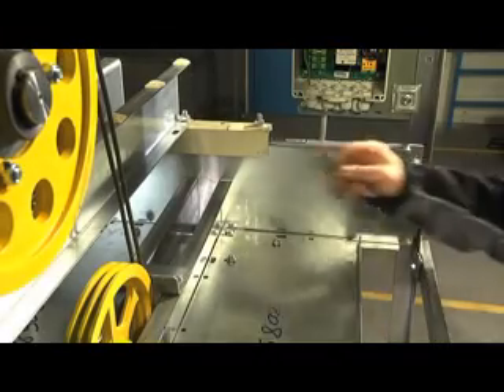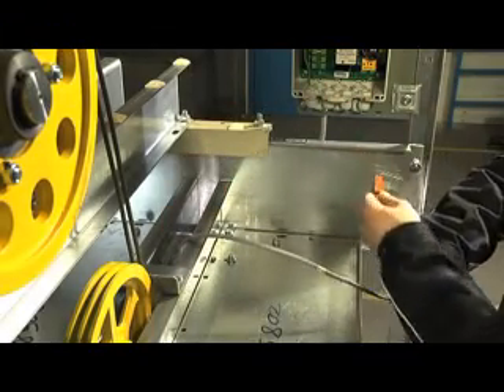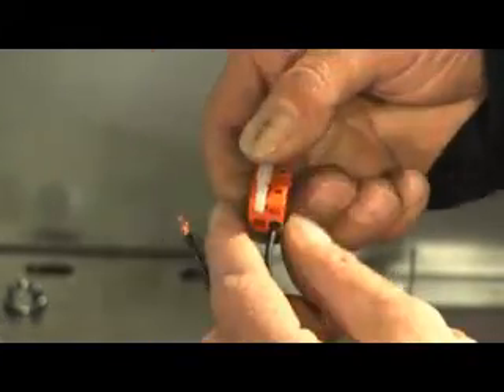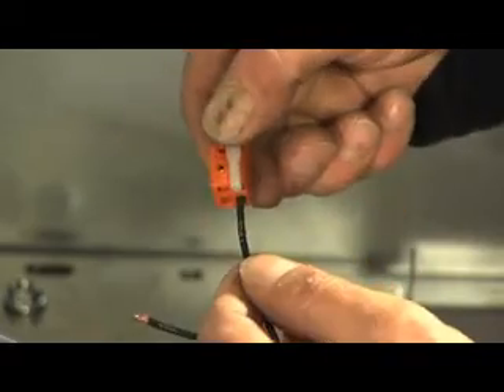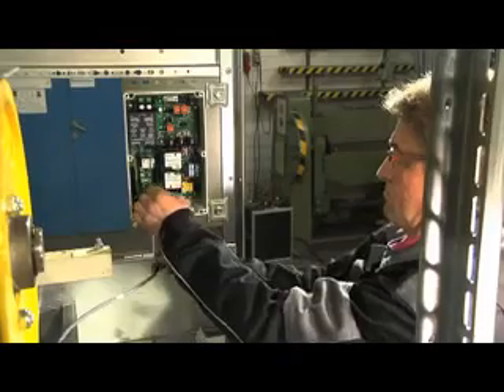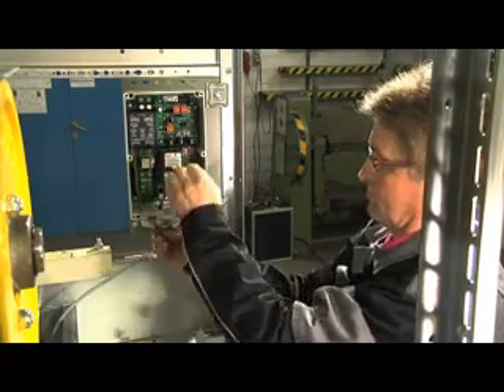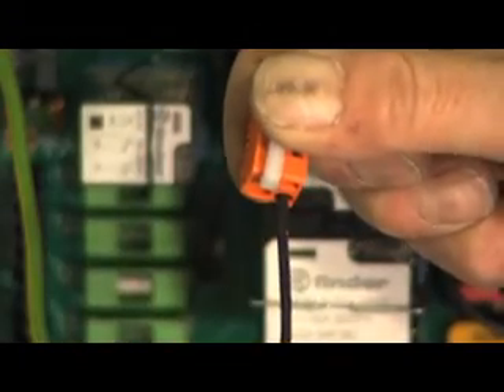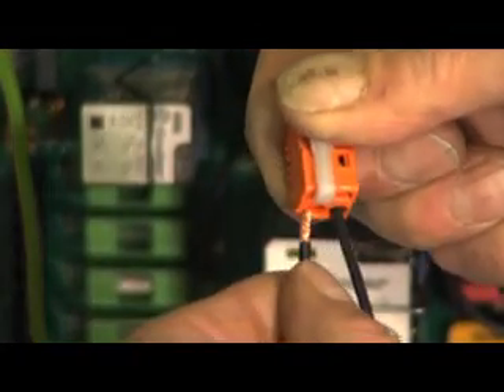Afterwards the technician starts cabling with, for example, safety line W7 for the landing doors. Already fixed connectors can be released with a delivered clip. The cable must be inserted into the casing and the connector must be installed and set to plug X08 as shown in the wiring diagrams.